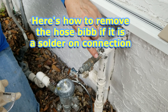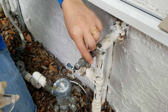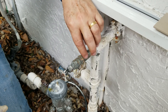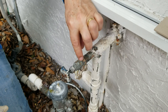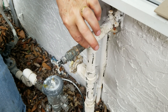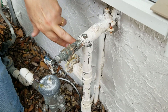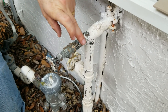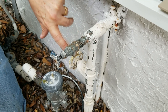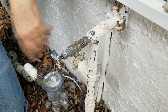If you look closely here, at first glance you might think this is one of those hose bibs that unscrews, but that's not the case. It looks like they soldered it inside this three-quarter inch stub out right here. That's not my preferred way of doing things. In plumbing, you always want to avoid soldering inside a pipe — rather you want to solder outside the pipe. So the first thing we're going to do is let the water continue to drip out, let all of the water get out. Then we're going to heat this up and melt the solder that's in there. It won't melt the solder until all the water is out — any time you have water in a pipe you won't be able to solder. We did a video on that and I'll put a link in the description.